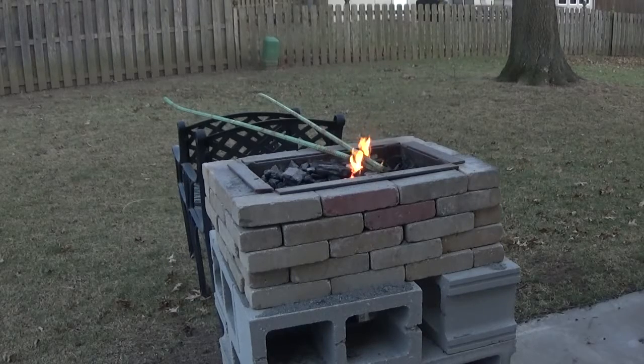Alright, now I'm heating up both bars at once so that by the time they both get red hot, I can work on one and the other will already be hot. Then I'll replace the one that I just worked on, take the one that's hot, work on it, and go back and forth like that so that this gets done a little quicker.